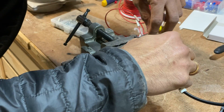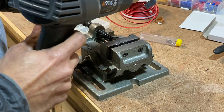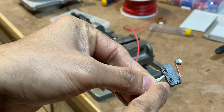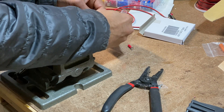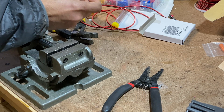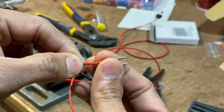Micro switches have three connection points — one is common and the others are normally open or normally closed, generally marked C, NC, and NO. Here you can see we attached the wire to the common as well as normally open, meaning we don't want voltage to flow when the switch is open. On the other end of the wire we installed spade connectors — those are crimped-type connectors. We ordered these from Amazon but didn't have the proper crimping tools, so we used pliers to crimp them. They worked out fine and make it easy to attach the wire to the switch, and they also look nice.